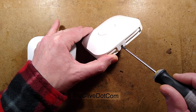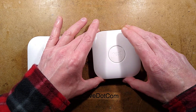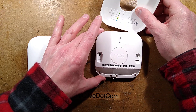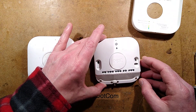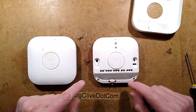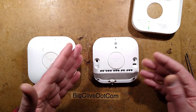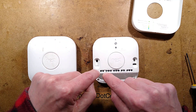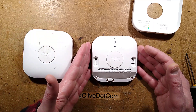If you loosen this screw in the bottom — it can be done while the unit is in situ — you just loosen it and lift the lid up like this. It reveals the electrical connections and a USB port. If you're not used to working with mains electricity, you should turn the power off before taking the cover off. For an electrician, it'd be quite useful to probe in there and see if it was getting 240 in the first place.